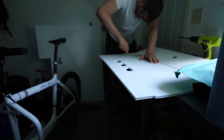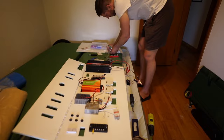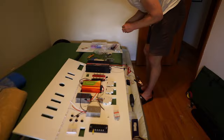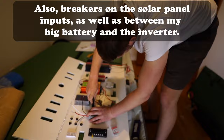Time to wrap up this video until the next one. Here I'm working on the electrical panel that's going to go inside the Cyberdrop at the front. I've got a 72 to 110/120-volt inverter, bus bars, two MPPT controllers, a DC-DC buck converter bringing 72 volts down to 12 volts, which goes into my 12-volt distribution box connecting through fuses to my lights, fan, porch light, exterior lights, et cetera. I've got round switches to control everything just how I want. I spent a couple of days putting this together — more details on that later. Getting close now.